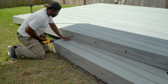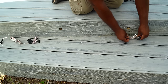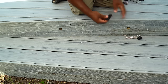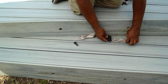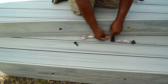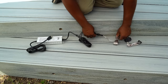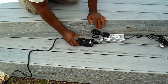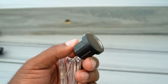The lighting setup is pretty straightforward. This is a one-inch recessed deck light. You can connect the light to an adapter or a splitter, and use an extension cable to extend the length. If your lights are close enough together, you can use a six-way splitter — just make sure to cap off the unused ports. The six-way splitter then connects to the light hub transformer cable, and that cable connects to the transformer. Finally, I plugged the outlet into a timer outlet, which should all end up going into a GFCI outlet since this is an outdoor project.